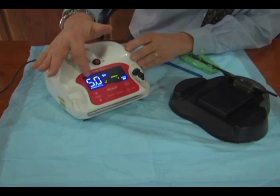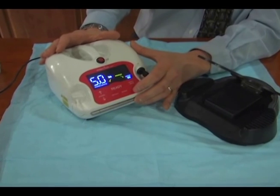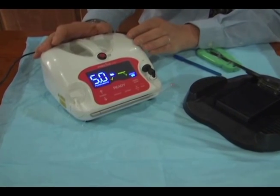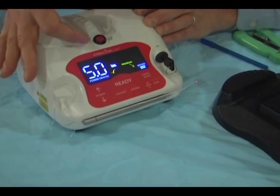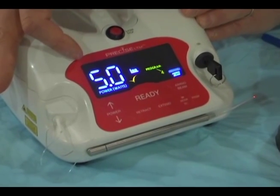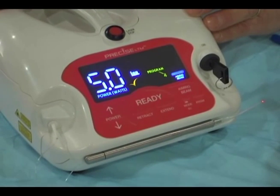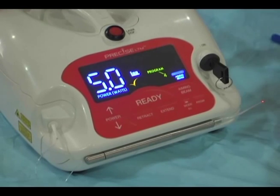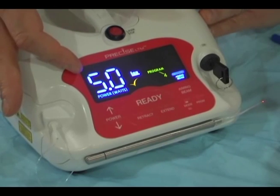You can also use the laser in a pulsed mode. In pulsed mode, our maximum power would be five watts divided by 50%, because your duty cycle — your time on and time off — is 50-50. What that means is the laser would be on, off, on, off: on 50% of the time, off 50% of the time. So if we had a power of five watts and it was on 50% of the time, that would give us an average power of 2.5 watts.